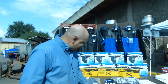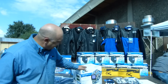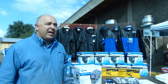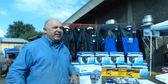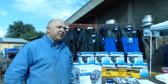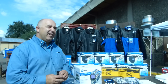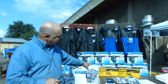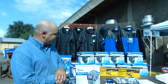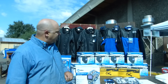I noticed that behind you, in a box there, is a new Miller Digital Series helmet. What can you tell us about that? Well, we're always doing stuff to up the game. One of the new things we've developed is ClearLight, which gives you true natural light — the most natural light possible in welding. Most hoods are set up at shade three or shade four, but you see a green or yellow highlight. This is actually a true natural color out of the welding hood. It gets rid of a lot of the pigment. A lot of people have a hard time seeing different lights. We came out with this right at the beginning of the year. We've had a lot of good success — people have been liking it. It actually came out a couple of years ago in a couple of other models, and now we've got it in all our products. All products are going to have ClearLight technology — other than the classic series, they all have it.